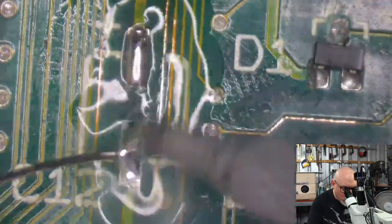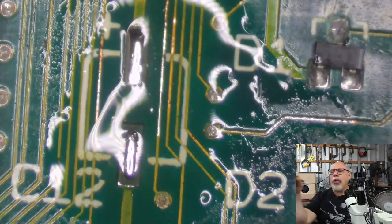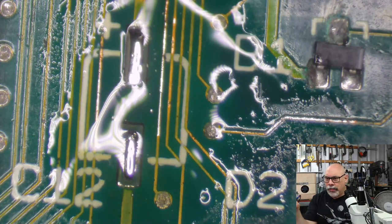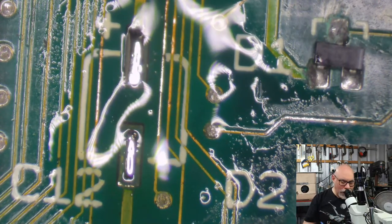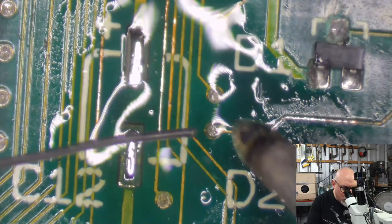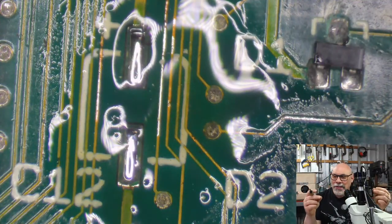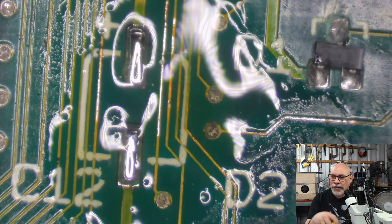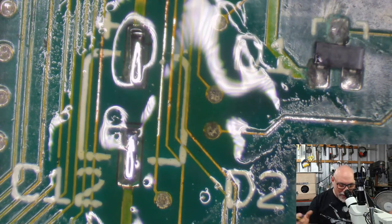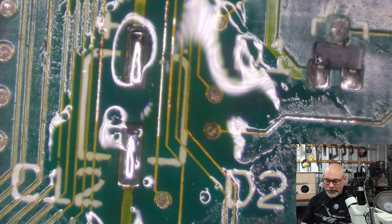One interesting thing that does happen is I have a UV globe, and sometimes when I've got lots of UV mask all over the board and I can't be bothered sitting there with the laser going from bit to bit, I just sit the thing underneath the UV globe and let it sit there for a few hours to cure. The problem with that is that it's UV light, and so insects are attracted to it. So I come back to the board and I find all these mosquitoes and stuff that have got stuck to the UV solder mask. They've gone to the UV light, they've landed on the board, they've landed in the solder mask, and then they've got stuck to it. So I get this board and then I've got all these mozzies that I pluck off the UV mask. Crazy, crazy times. Lots of stories.